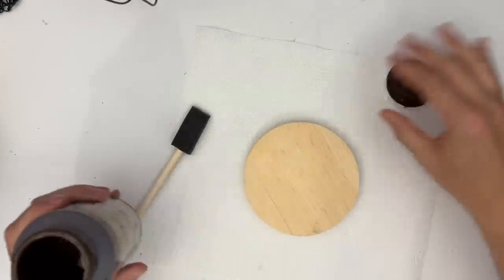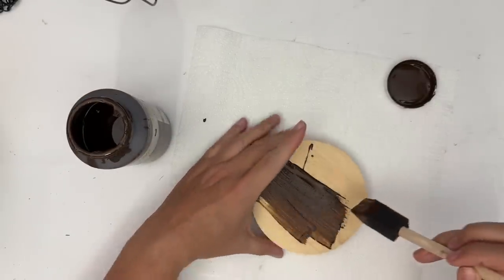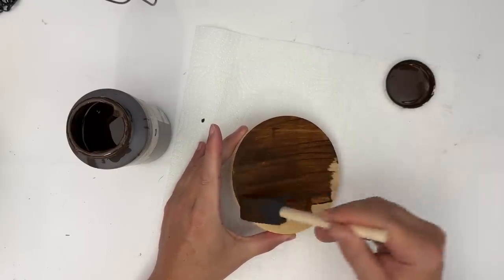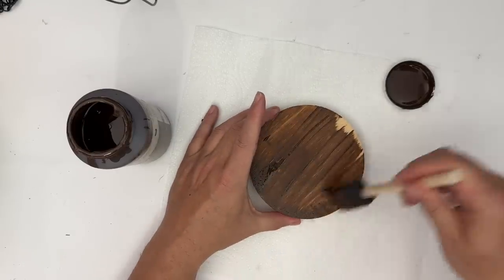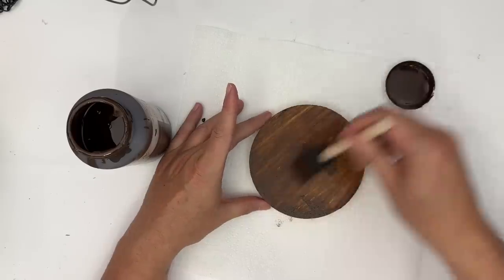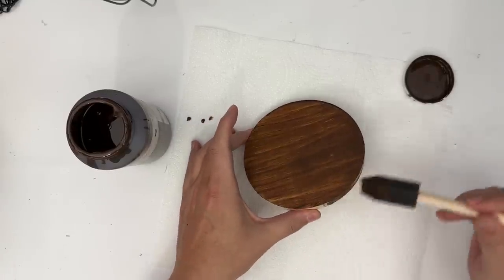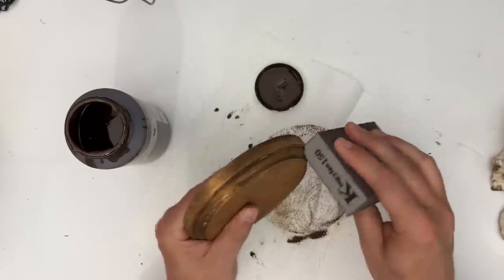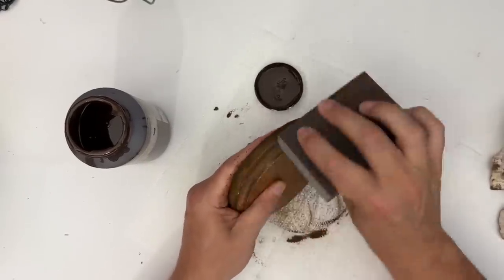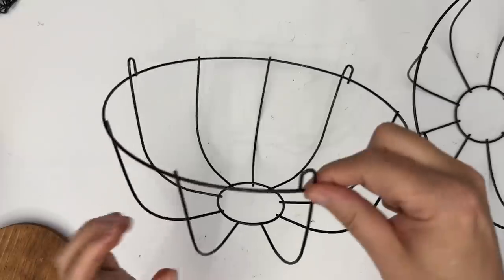For the antique wax, I went ahead and did a little bit of a heavier coat because I did kind of want this to be a very rich, dark color. A sponge brush works perfectly for these types of applications. The dirty washcloth application also works really well — the only reason I didn't go with that is because it's really wet from the previous DIY, but also because there is kind of this rougher edge on some of these pieces that doesn't really hold stain very well. In some areas where I did get some darker stain, I just took some sandpaper blocks that I picked up from Temu, and we're just going to rough those up and lighten those areas.